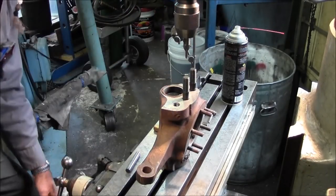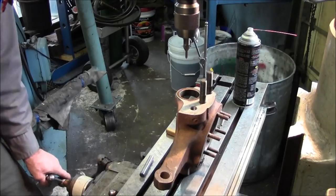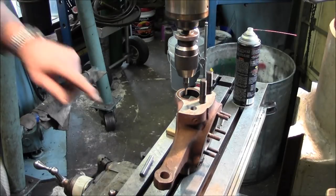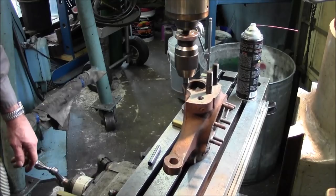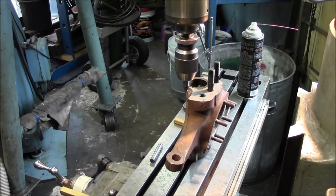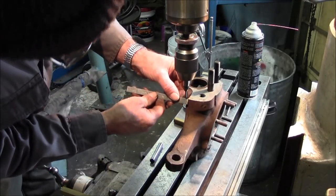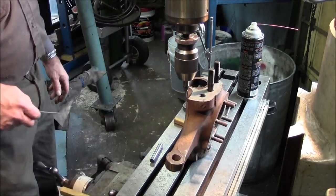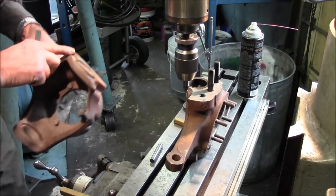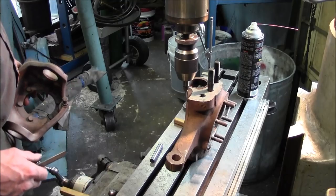And now let's come back to zero. We can always go back to those numbers. We know we're all set on our dial now, but let's stay right at zero. And let's come on down here. Let's go over this edge right here. Let's see what we look like. Right there. And let's take a measurement from that casting lip there. Out is exactly 200 thousandths. And that's kind of a flashing, whether that actually makes sense or not.